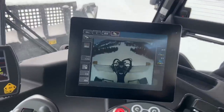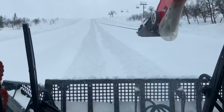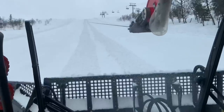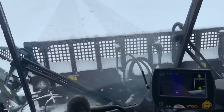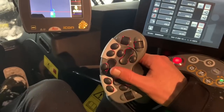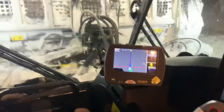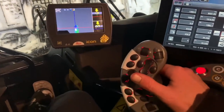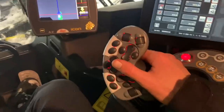The angle gauge is really handy when you're trying to follow a particular grade. This run we tend to build reasonably steep and stick to a certain grade. If you're doing landings on park features or takeoffs it's also quite handy — you can have it on the main menu when you're pushing to keep track of what grade you're sitting on. Probably my favorite thing on this machine is the joystick. It's got all the normal functions like blade drop and lift, forward and backwards — same as on snowcats, bulldozers, wheel loaders, all that sort of thing — but you've also got your tilt left and right.